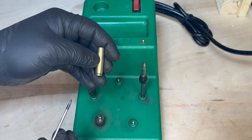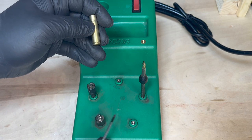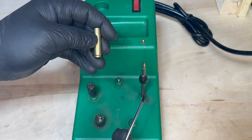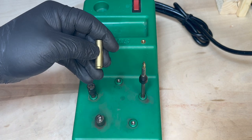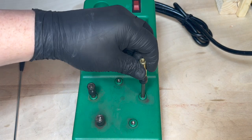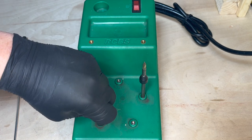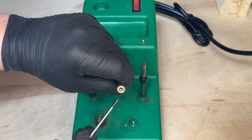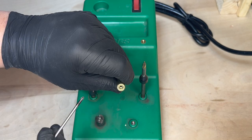I use a six-step process when working the brass. For the lower portion I have my RCBS workstation already set up. I have the crimp remover for the brass that I've converted from 223/556 into 300 Blackout. I also have the primer pocket uniformer and the flash hole deburr tool. So I'll go ahead and work the lower portion of my brass first. Now you can see that I've opened up the flash hole, taken out any crimp that's there, and also uniformed the primer pocket.